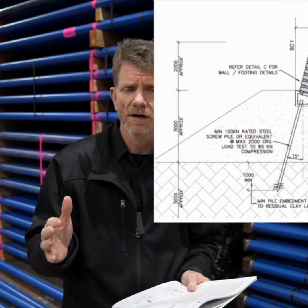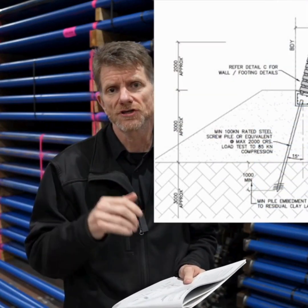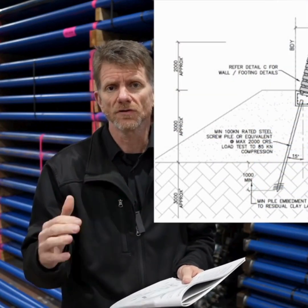In other words, a couple of piles that can eliminate the bending moment of a single pile and significantly reduce the lateral and shear forces in the top of a single pile.